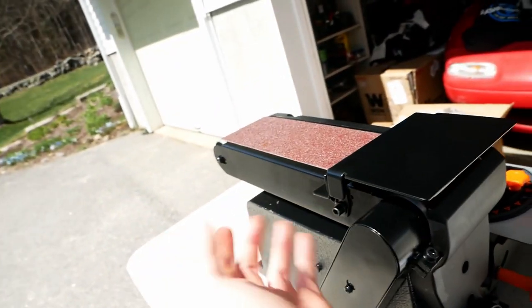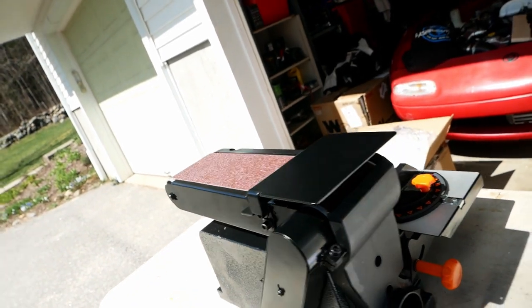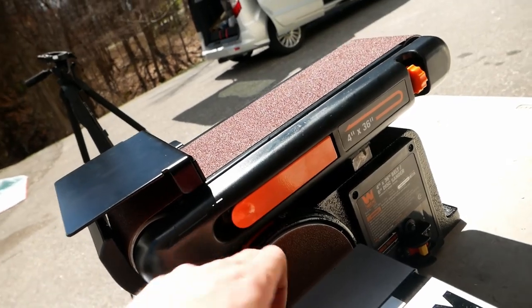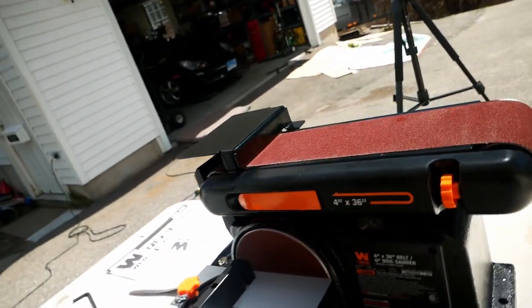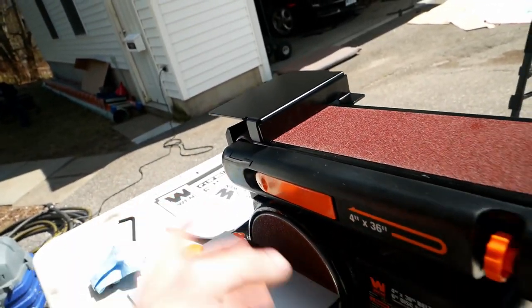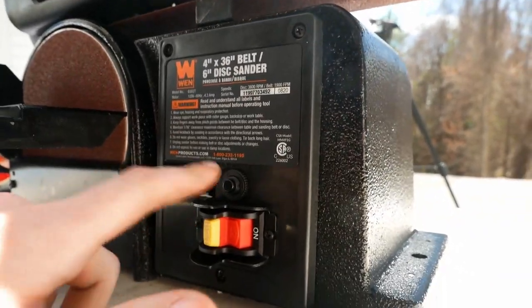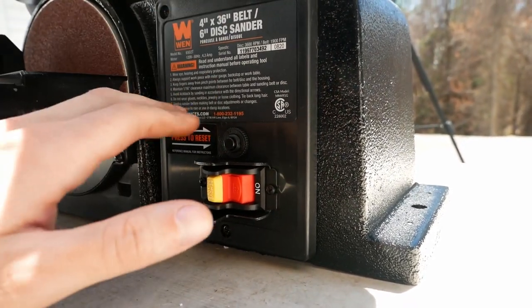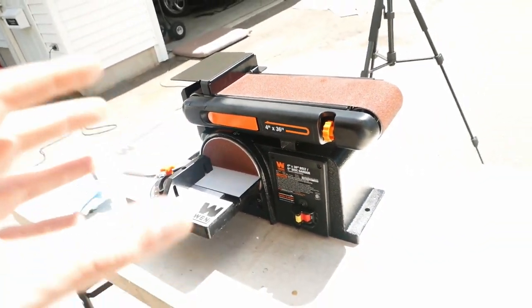This thing does turn up and down with that screw there — I could loosen that up and put the belt up, which I'll be showing you before the end of this video. And then over here, the disc sanding part does look pretty nice. One thing that's kind of cool about this, which I'll mention once we get to the specs, is this is sort of a geared unit, so this turns at a different RPM than this, which is pretty cool. We have our power switch here and a built-in circuit breaker, so if you draw too much power and you're really overloading this, you'll be able to just reset that without tripping a breaker in your house.